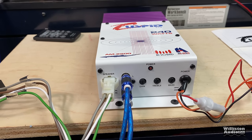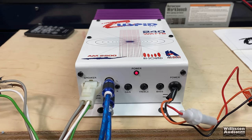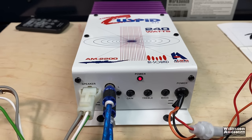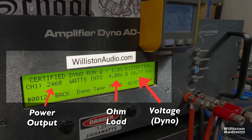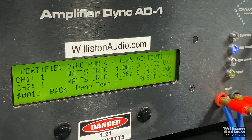I've literally not turned it on yet — fire in the hole, here we go. We have a red LED, so I guess that means we're good to go. I'm not sure why we're wasting the energy to do this, but we're going to do it anyway for the sake of fun. Let's fire up the SMD D'Amore Engineering amplifier dyno. On the left side you'll notice the power output, in the middle the ohm load, and on the right the voltage of the dyno. We're not going to measure efficiency on the clamp today. First up, we're going to try four ohms — it's rated 120 watts by two max.